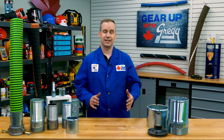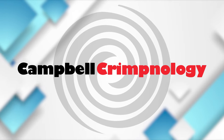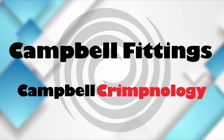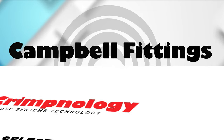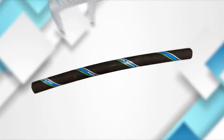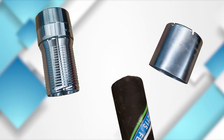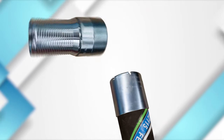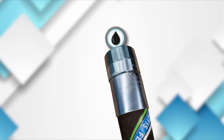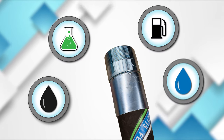So how do we efficiently and safely assemble industrial hoses? That's where Campbell Crimpenology comes in. Campbell Crimpenology is a trademark name for a hose crimping system designed by Campbell Fittings. This system is designed to give you precisely measured and easily repeatable results when crimping industrial hose. It can be used with any brand of hose by obtaining measurements from each end to be crimped. However, it only applies to using Campbell design hose shank fittings with Campbell crimp ferrules or sleeves. The Campbell Crimpenology system is perfect in many industries including oil transfer, chemical processing, fuel delivery, water transfer, and many more.